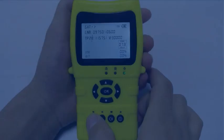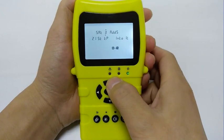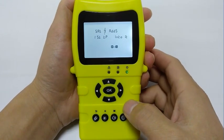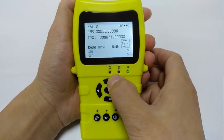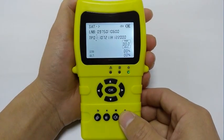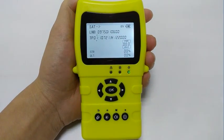A new transponder can be added by long pressing the edit button. Before going to the edit page, the software will ask you where the new transponder is being placed. Here we choose a non-existent satellite so that we can add a transponder to a new satellite. Don't forget we have restore factory settings as well — long press the set key with gear icon, and it will ask you if you want to reset to factory default.